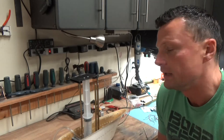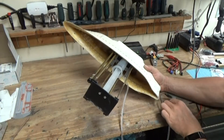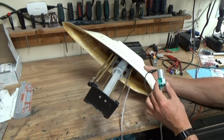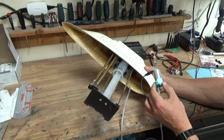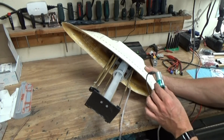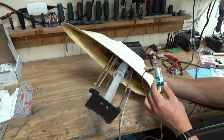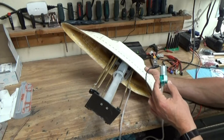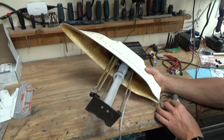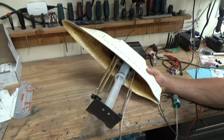This is the air pump — one of two that will be required for operation. I sell these on NautilusDryDocs.com. It's a little 12-volt vacuum pump. There'll be two of them because these diaphragm pumps are not reversible, so I need one dedicated to each function: raise and lower. That's certainly not a problem — just use an electronic switch that toggles back and forth.